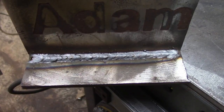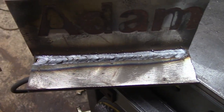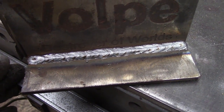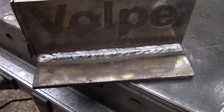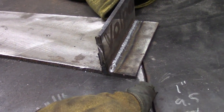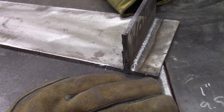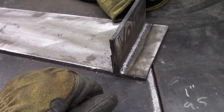Alright, that's about it — this is the low alloy side. Took me about thirty seconds to make that weld and I tried to do the same over here. Looks very similar; I think I kept them between thirty and thirty-five seconds, so just about the same amount of heat into both of them. I'm going to let them cool down now and then hit them in that direction. I want to see the weld just kind of crack right off and the piece go flying.